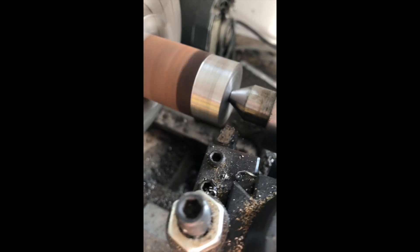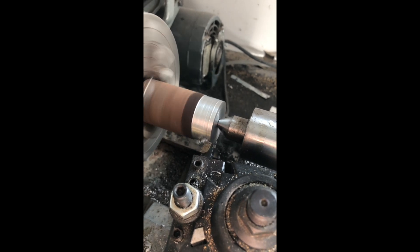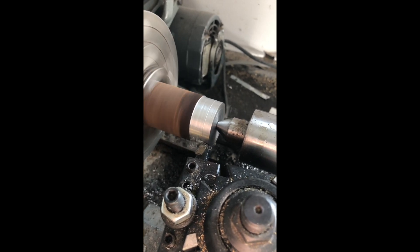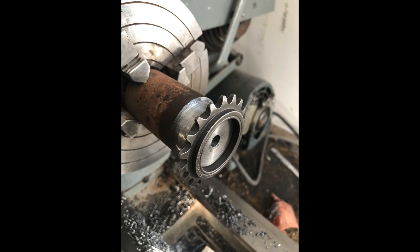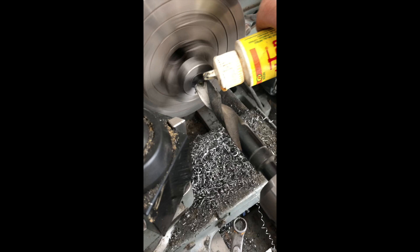And if this thing doesn't work, I'll go over to my dad's shop. He has a large South Bend lathe, which I absolutely love. Here I'm turning down this metal chunk so I can fit this other sprocket, and of course I want a super tight fit. I'll press that in place and then weld it.